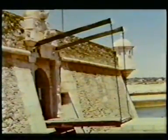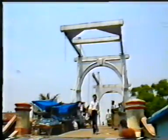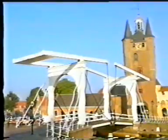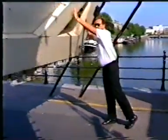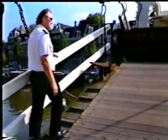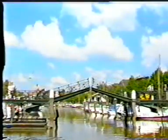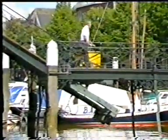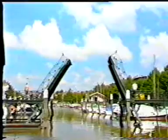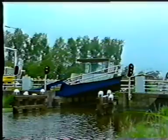In spite of these improvements, this development proved to be a dead end. More viable was the use of balance beams. This led to the bascule bridge with a counterweight in the balance frame. Until about 1800, these bridges were constructed of timber. Afterwards, this material was steadily replaced by wrought iron and later by steel. Now, equilibrium can be maintained in each position, thus requiring a minimum of energy to move the bridge. Integration of the balance frame in the deck gave birth to the bascule bridge.